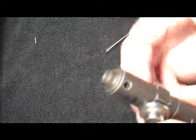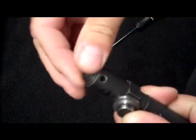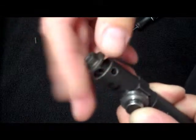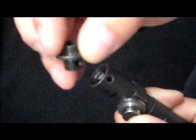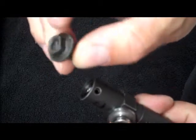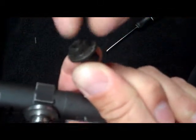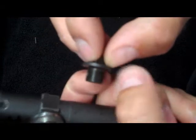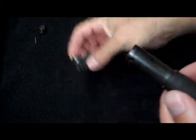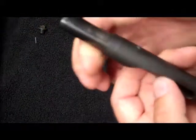This isn't to be confused with a roll pin — this is a solid metal pin only used for the bolt plug. Now once that pin has been removed we can go ahead and rotate our bolt plug off. There are two different types of these: this is an older variant where this can be turned with a wrench, and then there's just a flat one. Once that's off, our actuator is going to slide right off the back end of the bolt. The purpose of that actuator is that's what drives our feed cam and our top cover.